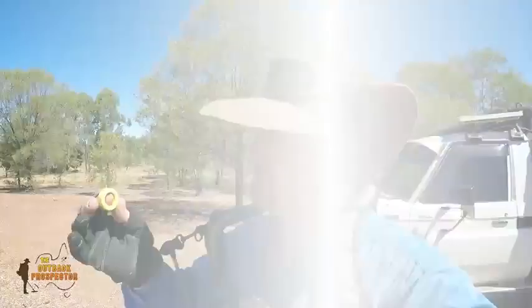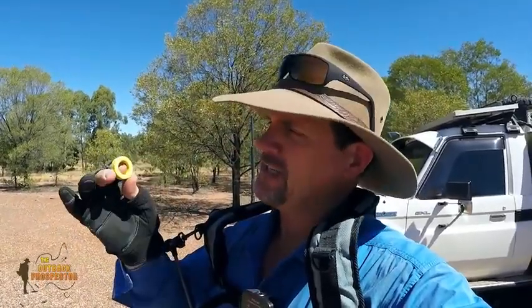Okay, I'm now going to demonstrate a different method of ground balance in the GPZ 7000. Essentially what we're going to use is a ground balance aid in the form of a ferrite. And essentially what this ferrite does is it emulates certain components in the ground. Now, not all ground has large amounts of this material associated with it, but the ground that has varying amounts of it can impact on the ground balance of the GPZ 7000.